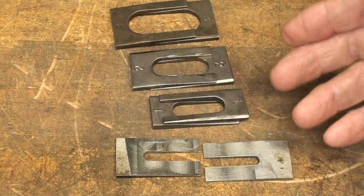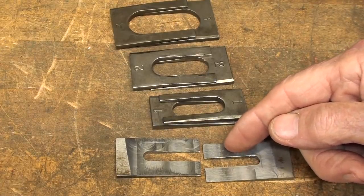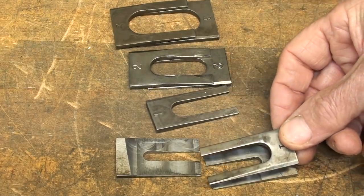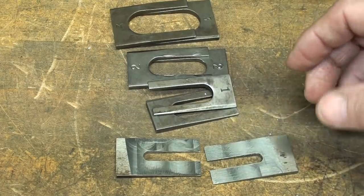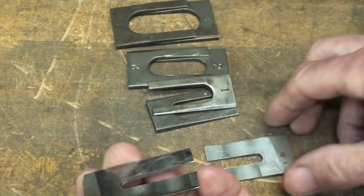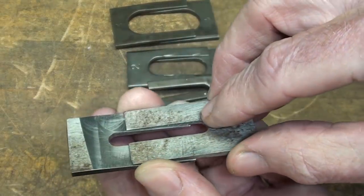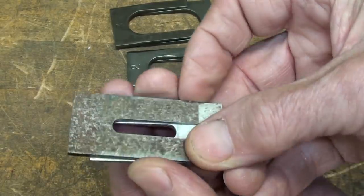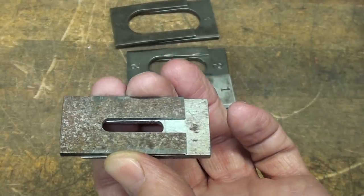However, they can be hardened if they fail. It's about a quarter inch slot in here — I used a quarter inch end mill — but you can see how much smaller these are than even the number one size. It's a little wider than I need, and probably longer, but that is irrelevant. So these are ready to use. I think you might find it interesting how I made these, although it's probably pretty obvious. Let's put them to use.